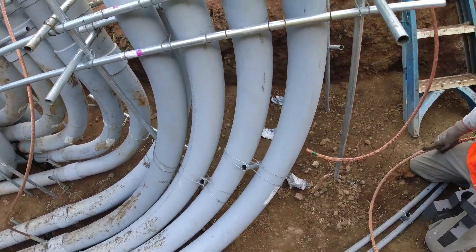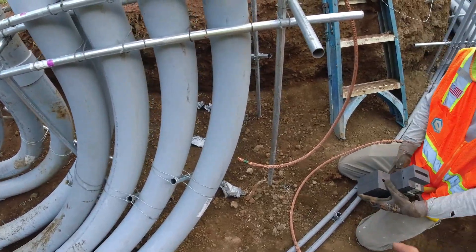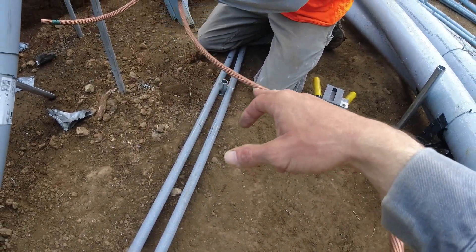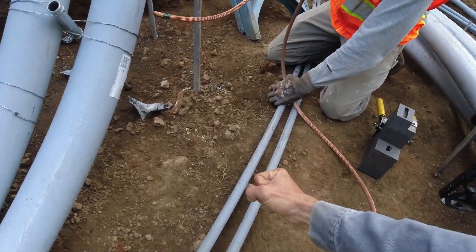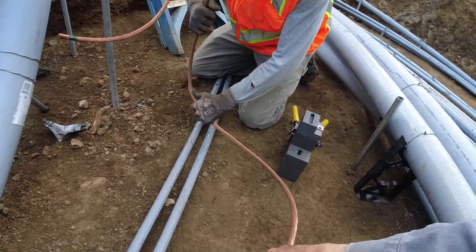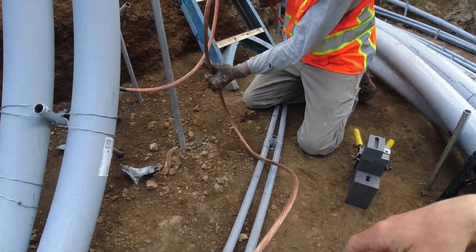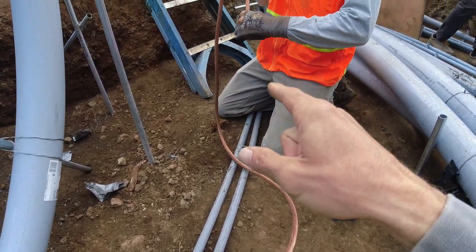At this point don't even bother putting the mold on, just look at it. Bend the wire as close as you can. See how it's curved on the dirt? You're going to need to straighten out whatever section you're going to use. The section that's going to be your runner needs to be traveling straight up. Just like that — yep, perfect. We could even do the weld up there.